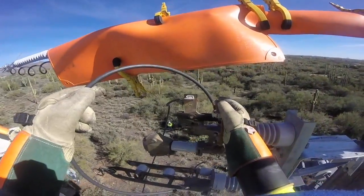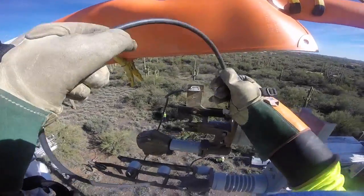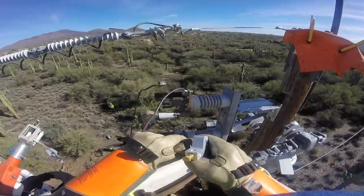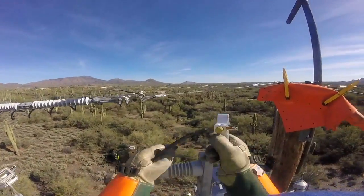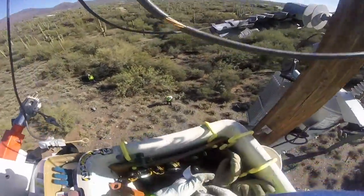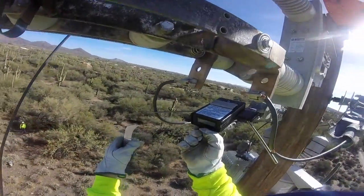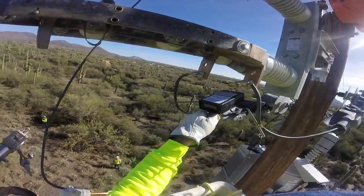That was good and valuable to listen to the linemen talk about what they were doing up on the line. Next you're going to see them connect the regulator leads. What he's holding here is called a power tap, and we're going to see that landed on the line in just a bit. They're also stripping away a small piece of insulation around this wire so they can get a regulator neutral detector in there later to check for voltage without having to go right to the voltage regulator itself.